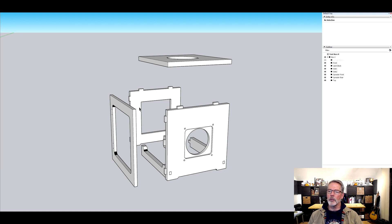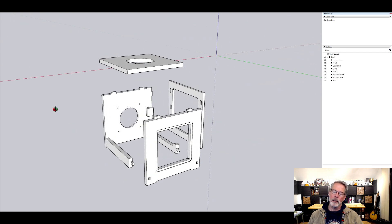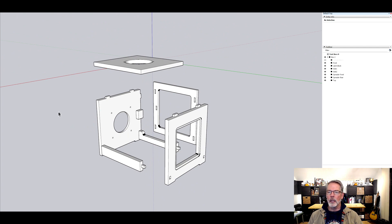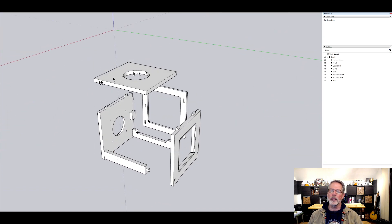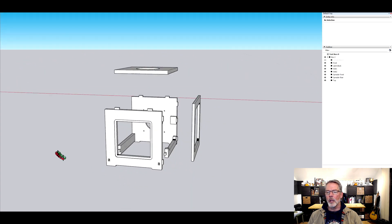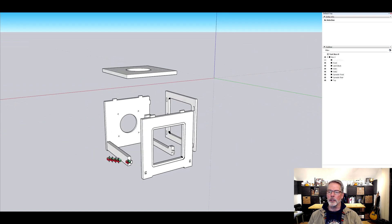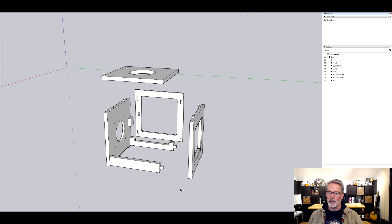So I decided to do something different in this build and use mortise and tenon joints to help the assembly process. This is a little test box I've designed to explore that concept. We have tenons and hidden mortises, which provides a really nice and clean look. On the sides the tenons go all the way through, just because I'm machining this face, which makes it a little bit easier. Once this is cut out it assembles very easily — everything clicks right together and the faces square everything up, so pocket holing it all together goes very smoothly.